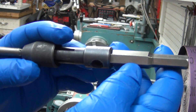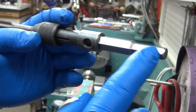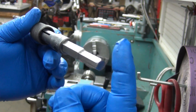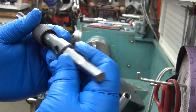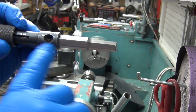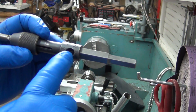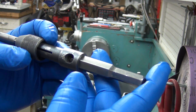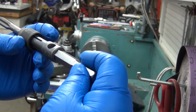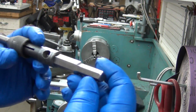A while back I made two of these — one for a guy at work. I took some hex bar and put it in the mill, clamped it in the vise, and came up on the side — piece of cake. Then I drilled and tapped a hole into both and put a stud in there, basically a bolt with the head cut off, put them together with Loctite and cranked them down tight. So now I have a six-sided adapter I can put in a drill.